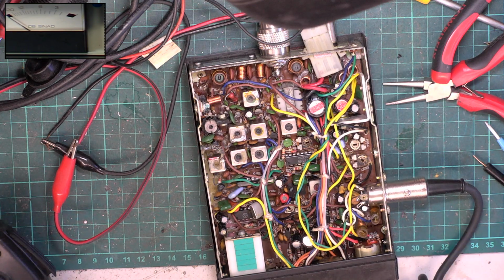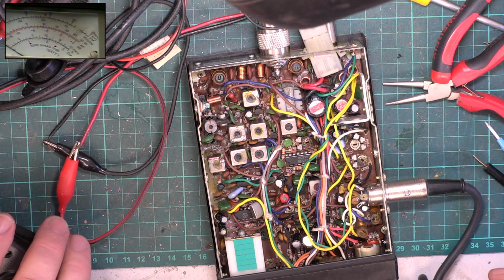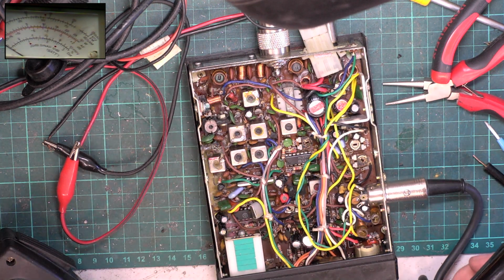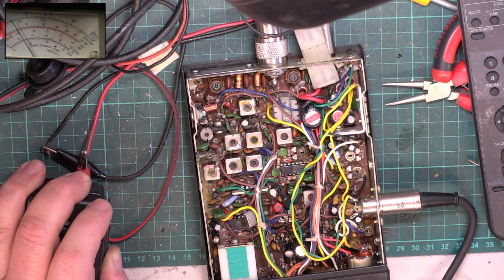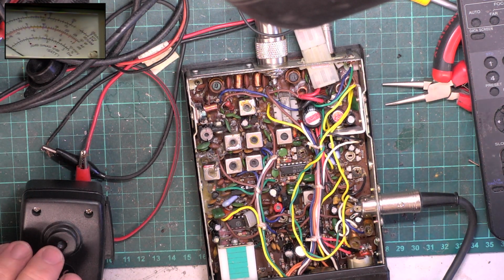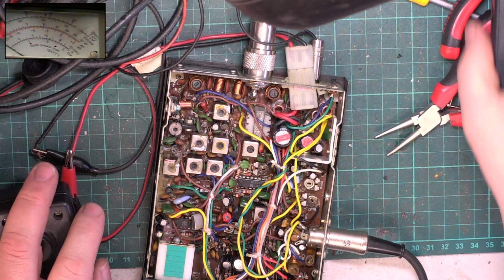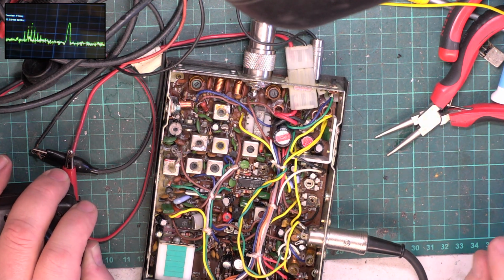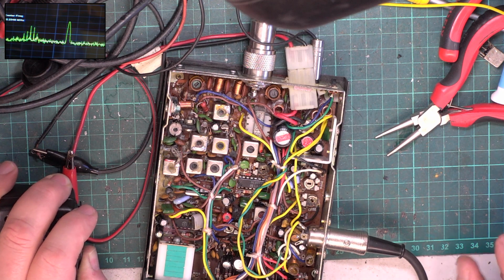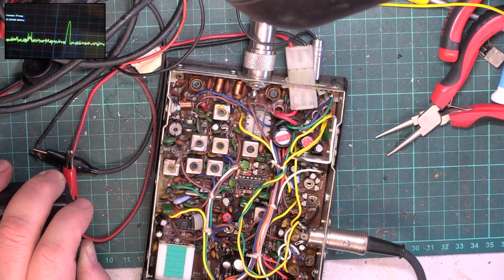So before we leave this, just make sure it's still doing some power. Helps if we turn it on. Yeah, 3.5 watts. So better go put the signal there. We are. So there's our fundamental frequency of 27.79125, and we'll just go up looking for some junk.